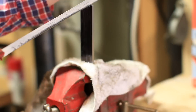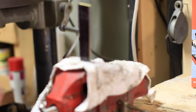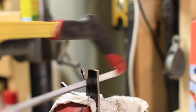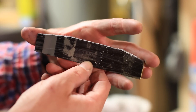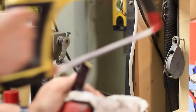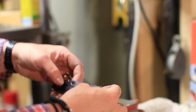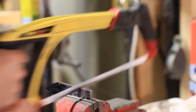We've got our chunk cut out, so now we start cutting out the profile of the knife — this will be the back part where the blade is. You want to cut a little bit wide, not right to your line; you want to get fairly close but take out all those cut marks with a file. Then we work on the actual curve of the blade, doing a few angle cuts. Obviously depending on your saw, you might have one that cuts curves well too. This is a video to show it can be done by hand.